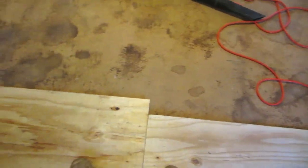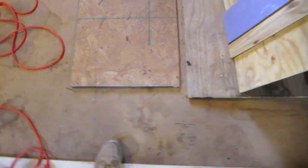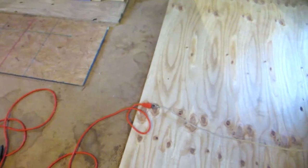piece. The next piece of plywood is going to be 4 feet here, and then 8 feet is going to go out around here, and then another 4 feet over here. That way we've got a straight edge across the seams, like flooring. Yeah, it is flooring, huh? Don't want to line everything up like this. Alright, so we cut that piece off.